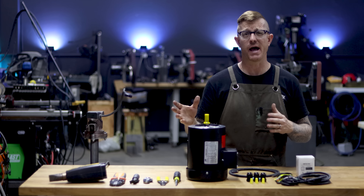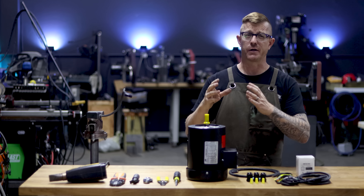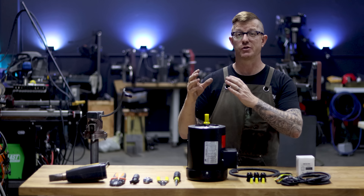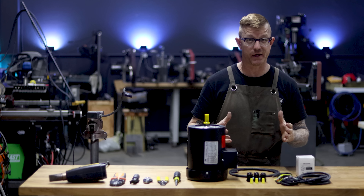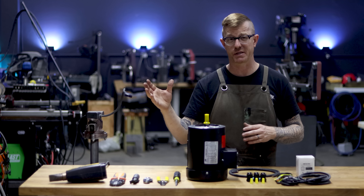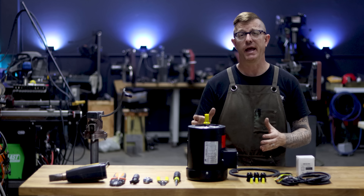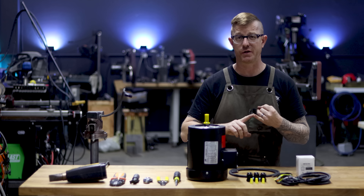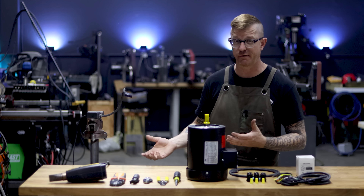At some point if you upgrade your workshop to 220, you can change the jumper and rewire this thing to run on 220 single-phase power. This is my preferred setup for running a 2x72 belt grinder. A lot of guys use this same setup for knee mills and other machines. When I tell folks that KB Electronics' variable frequency drives can upscale 110 single phase to three-phase 220, they are blown away.